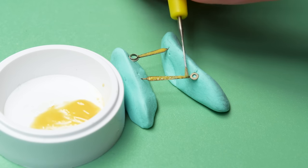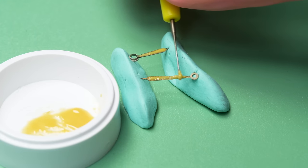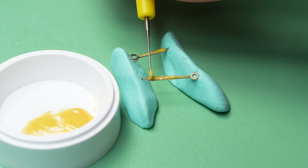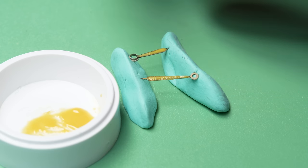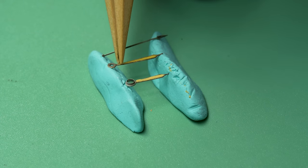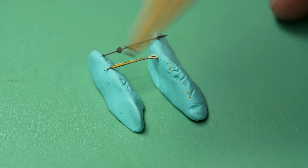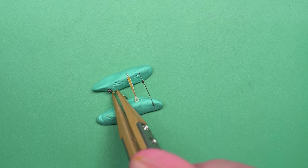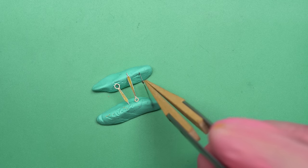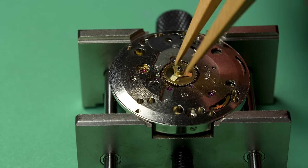This is an experiment just like anything else. I did try it out on that set of hands so I could get used to working with it and get an idea of what color it actually produces when dried. I'm using an oiler — the same type of stick used to put oil into pivots — to gently spread out the lume over the back of the hand. Since it is a liquid, it will fill into the gaps automatically. After 24 hours of waiting, that looks pretty good. Let's see how they look on the other side. Hey, that's actually not too bad. I like that color — that looks like aged tritium. That is exactly the type of color you would expect from a watch of this age.